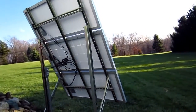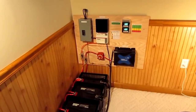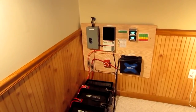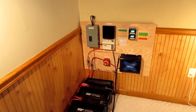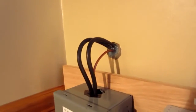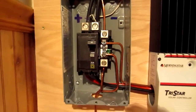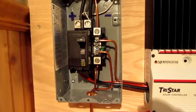We're inside now. Before that, one more note: those main support beams have 36 inch center lines going into the ground, which lines up nicely with the mounting holes on the Renogy panels. The PV cable and grounding conductor come through the wall via schedule 40 into a Square D QO series breaker box. Inside there is a 40 amp dual-pole breaker — both the positive and negative PV cables go to that breaker so I can shut down power coming in from both.